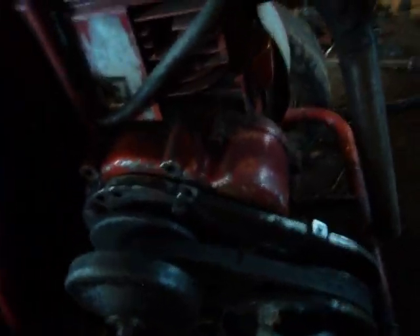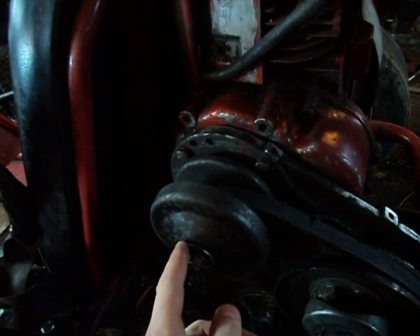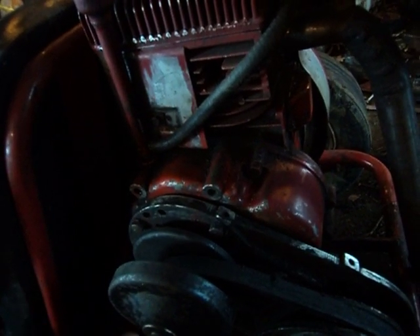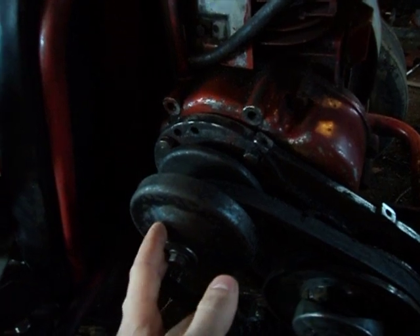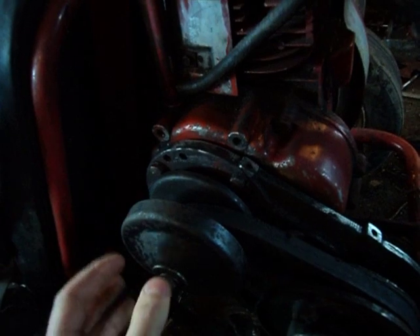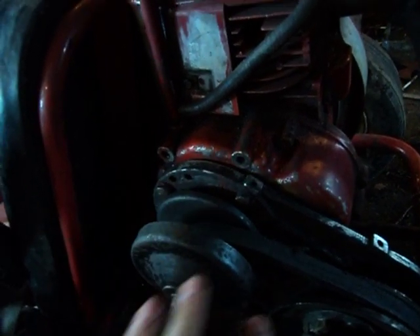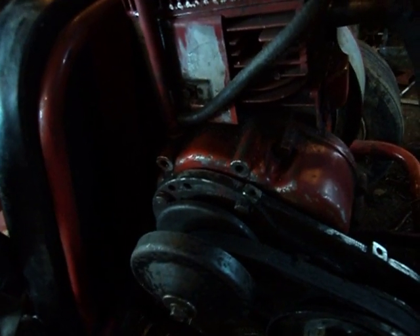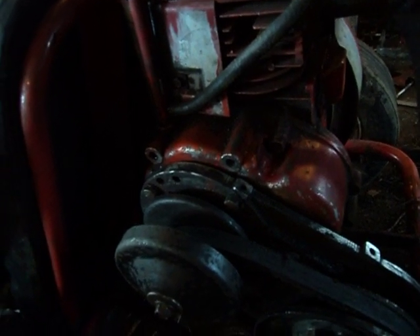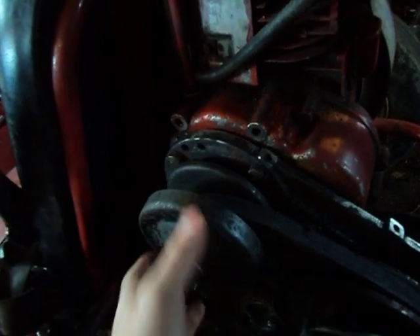The shaft on this motor I think is one inch and the one on the other motor is I think three-quarter. I know this one is a lot bigger. I should have made a video of this because I bet a lot of people run into this problem. I took a grinder and shaved it down, turned it, shaved it down repeatedly until the clutch would fit on, then I ground a flat spot so the key went on. It works.